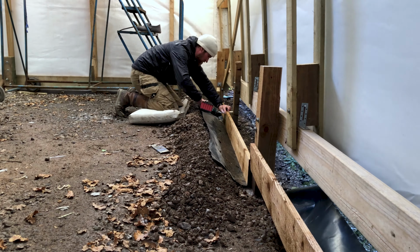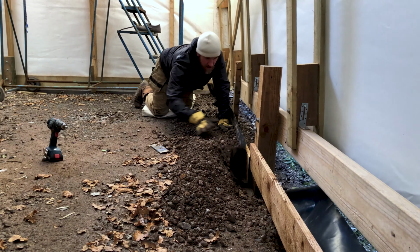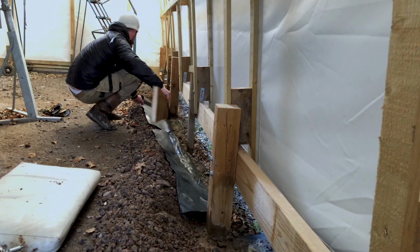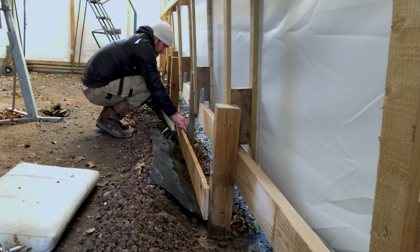Another cause of condensation was the subbase getting soggy from surface water, so I revealed the DPC which was under it and folded it up to create a bathtub floor. Again, it would have been easier if I'd just done this to begin with.